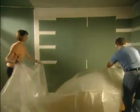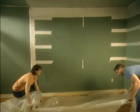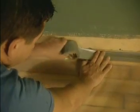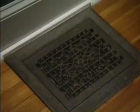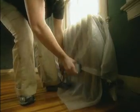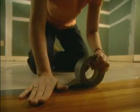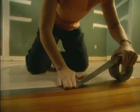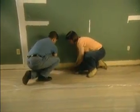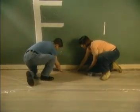Now you need to seal off the work area to prevent dust from spreading into clean areas of the house while you're working. Cover the floor, counters, air vents, built-ins, carpeting, and any household items that you couldn't remove. Use heavy-duty plastic sheeting as a cover and secure all the plastic with duct tape. Plastic sheeting is cheaper than drop cloths, and you'll need to throw it away after the job.